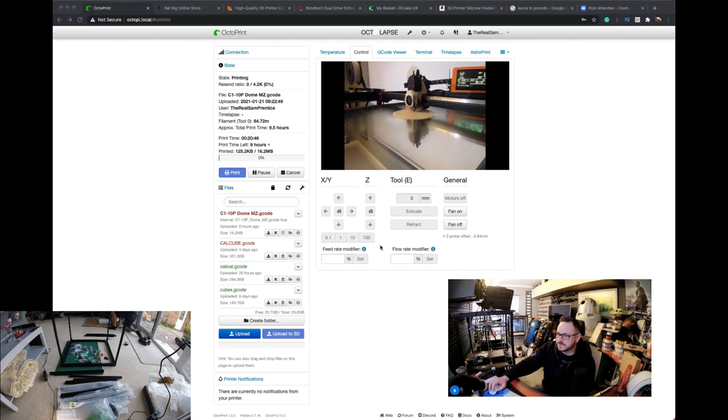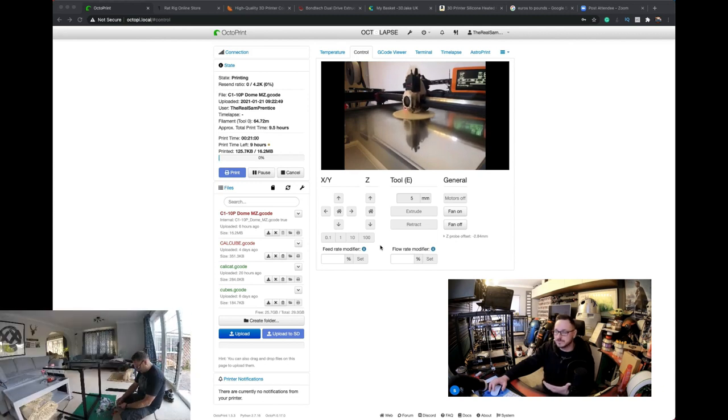So that's printing really nicely at the moment. Again, this 500-500 printer is using a 240-volt heated bed. It heats incredibly quickly. And of course, I'm using a 24-volt system, Bondtech extruder, BMG M, and also the Slice Engineering Mosquito. Well, we'll go through that in a minute.